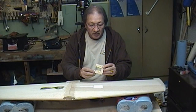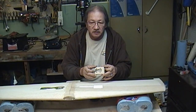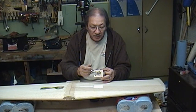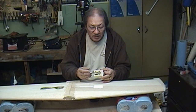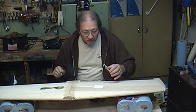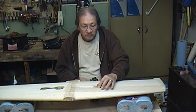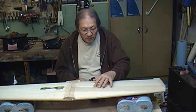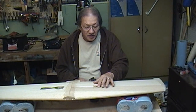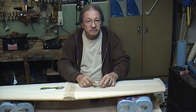I finished drilling the holes and pressed in the blind nuts on the back. Around the blind nuts I put some CA glue - a little bit over the top and all the way around the sides on each one - and that just keeps them from falling out later. What we have to do now is set this in here and glue it in. I'm probably going to use 15-minute epoxy. I'll show you how to keep the epoxy out of the blind nuts. So let me mix up some glue, prep this, and get on with it.